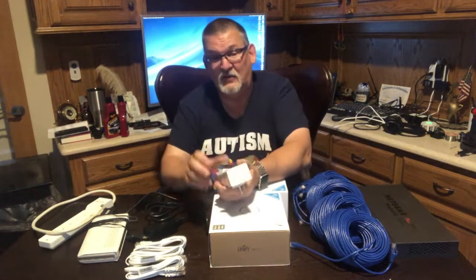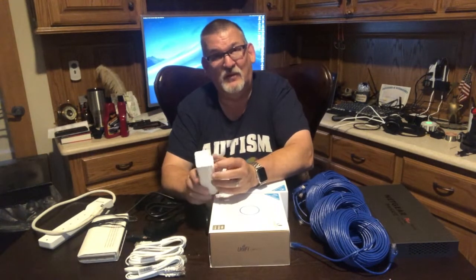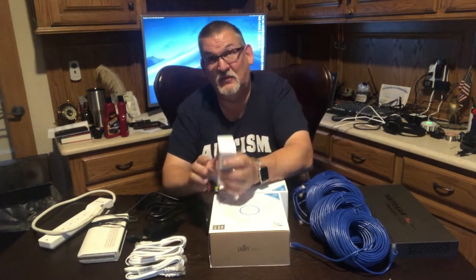Right now, if my house is this big, my Wi-Fi propagation footprint is right on the outside of both sides of the house. In Wi-Fi, the farther you are on the outside of that footprint, the less data rate or speed you get. So you don't get the full bandwidth the Wi-Fi is affording you the farther out you get on the edge. So what you want to do is have a footprint, and then have overlapping footprints, whichever way your house is, so that you can encompass more area in your house and have the same speed.